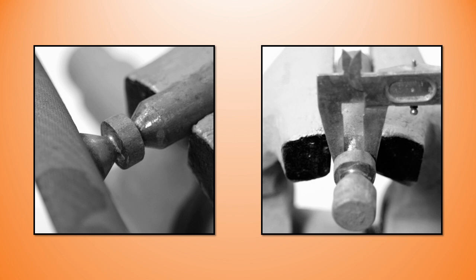I like to use a half-round bastard file to clean up the fullered grooves, and that helps leave a slight curve to the transition area between the taper and the collar material. You did your test piece so you can look at the finished dimension, and I'm using a set of calipers here to check that dimension on my blank.